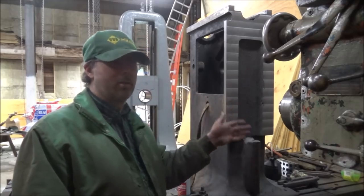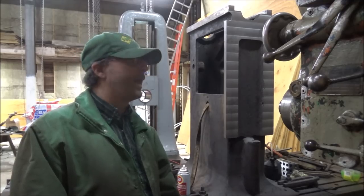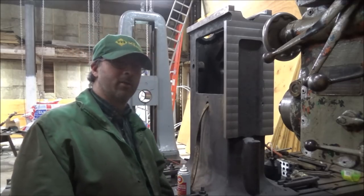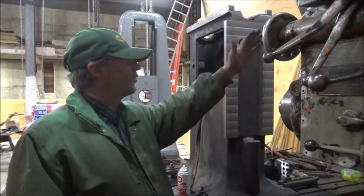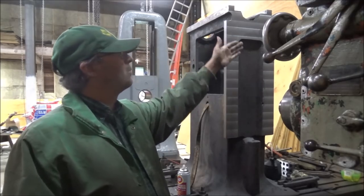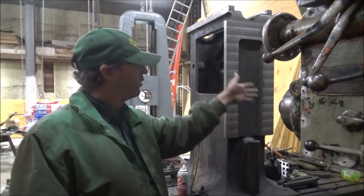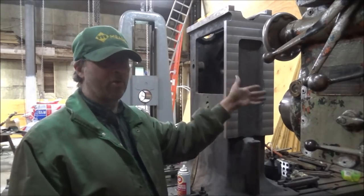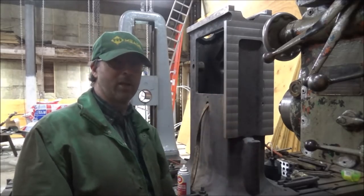It would have been a lot of stick out to swing that. You're talking over a foot out on the fly cutter. I would bet that if you fly cut that, it would probably not be that close, because it would have so much stick out, the rigidity would be so limited that I think you would get skipping when it came on and off the surface, and you would have to do it across one direction in order for the fly cut to get a complete circle anyway, because anything that you were out of tram would result in inaccuracies.